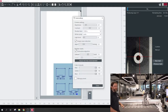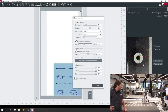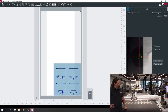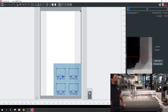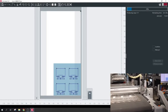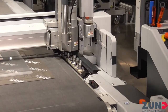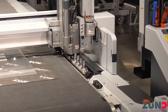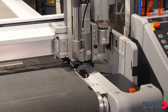We're also developing ways to do virtual training and virtual demos so we can keep America running. Just adjusting the register marks — these marks are a little bit smaller. We can do all that on the fly with the ICC camera. You can have preset settings — you might potentially be registering polka dot material, so being able to set a minimum and maximum for the dots and save a preset for that means it's just one quick click and away you go.